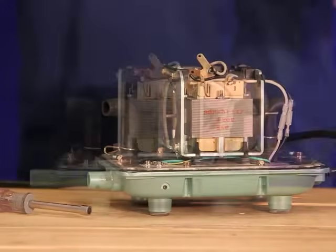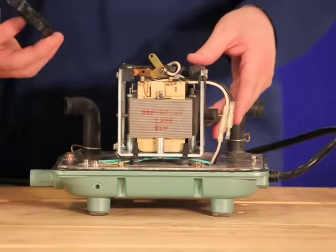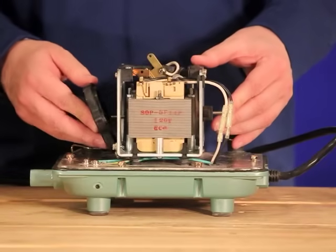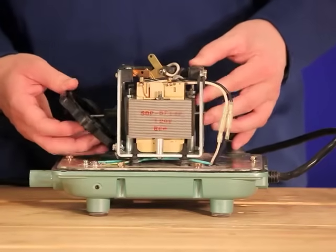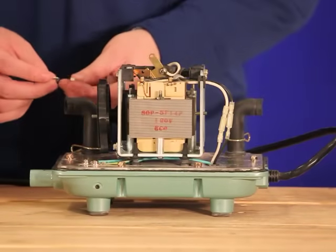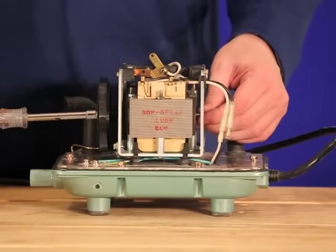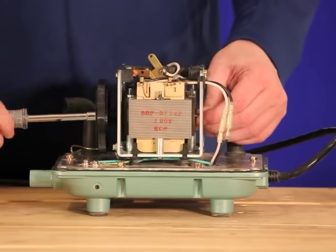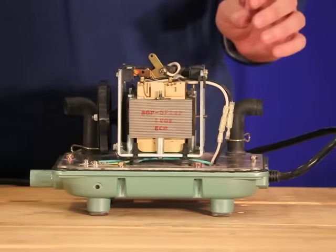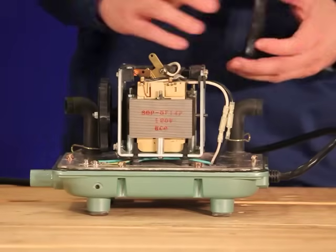Go ahead and slide that back in — now it is time to put on the new parts. Go ahead and install the new diaphragm kit. The diaphragm goes on only one way; there are slots that it lines up with and slots that connect it to the rod block in the middle. Go ahead and put the new screws on that come with the kit. The nut — the beveled side is going to go out, and it's made so it can't come back off the other way. Now that that side is on, you will go ahead and put on the other side.